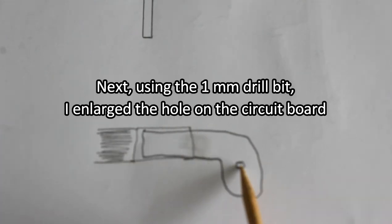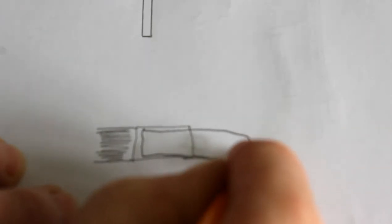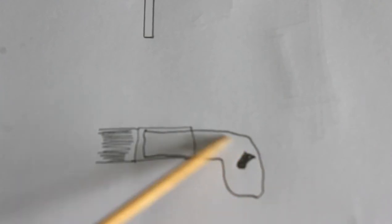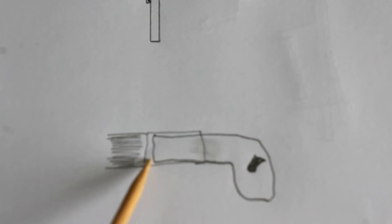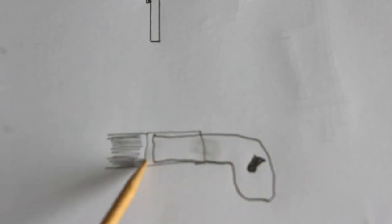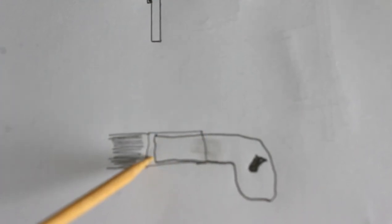At which point I pushed the turret through the board from the other side, so the turret piece is sticking up, if you will. It's coming through a bit like this. At that point then I fluxed all of this and flowed solder around here, and the solder actually was quite happy just to flow down here. And when I initially pushed this down, I'd had enough solder underneath it, so a lot of it came up on top. So by the time I'd finished, this whole thing was covered with solder and bonded to the pre-existing piece of track or trace that was available.